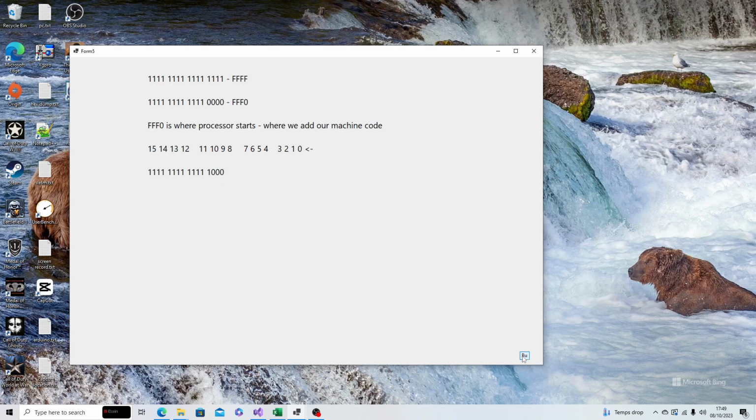So that's what we're actually seeing. And what is that in hex? That's actually FFF8. So in fact, FFF0, because we've dropped off the actual A0, is presented to the EPROM as FFF8. So therefore the EPROM start location is not FFF0 but FFF8, because that's what's being presented to the EPROM, because we've lost that last A0 line.